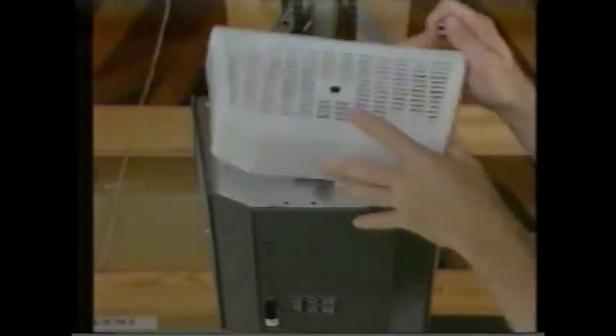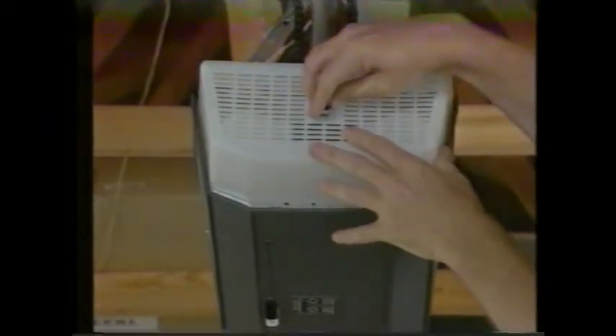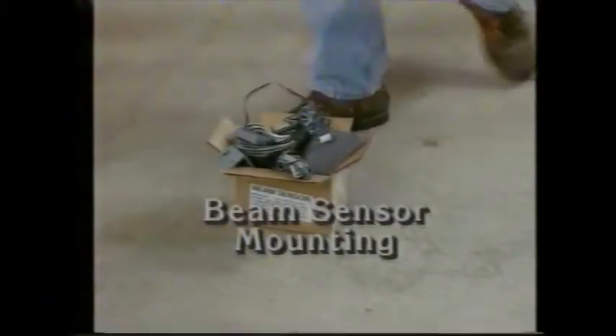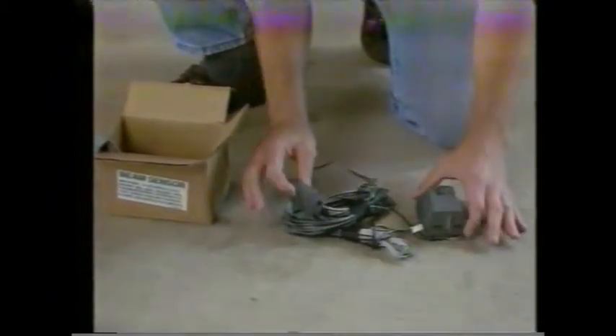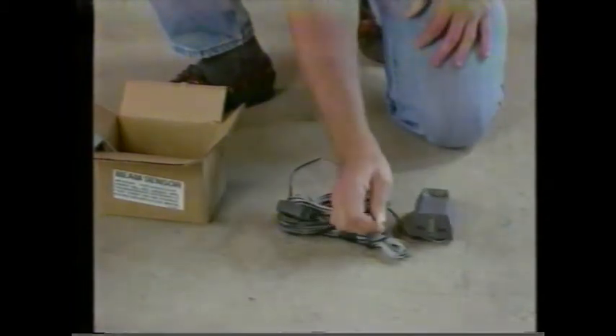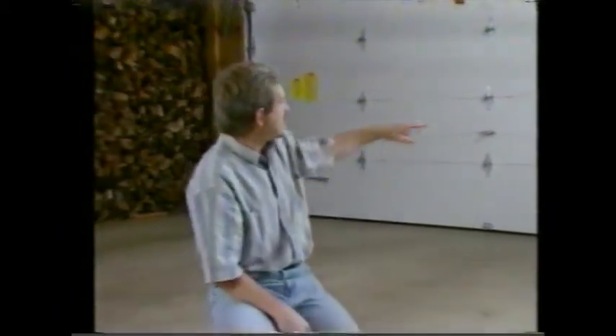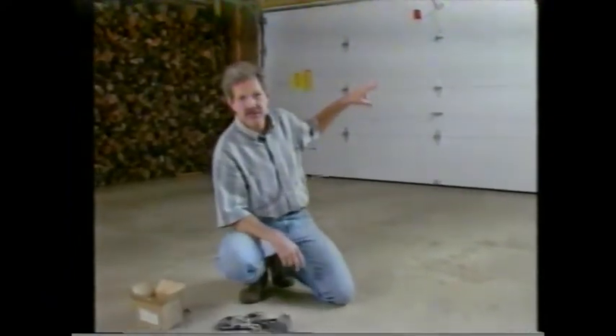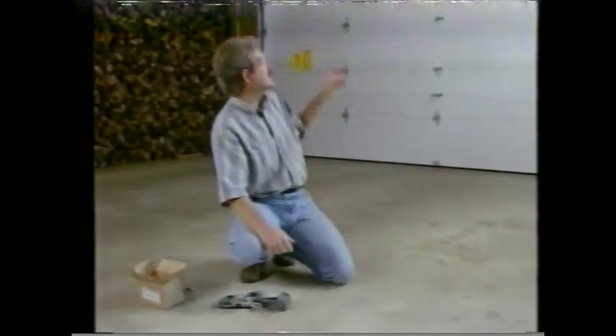The power unit has a light that automatically comes on for 4 and a half minutes when you activate the opener — install the light bulbs for that now. Your Stanley garage door opener comes with an infrared beam sensor; it's easy to install and comes all pre-wired. Attach the two units to either side of the door, run the wire around the opening, and plug it into your power unit. This sensor is a safety reverse — if the beam is obstructed, the door will go into the full open position. Before installing the sensor, determine which side of your doorway gets the most sunlight, as sunlight may affect the operation of the sensor. Mount the receiving unit on the side that receives the least amount.